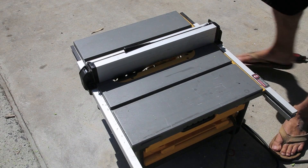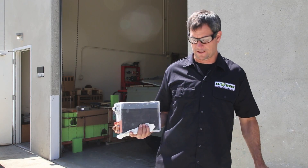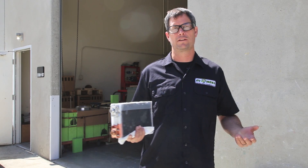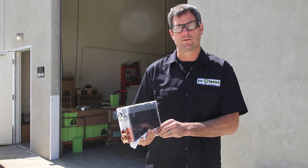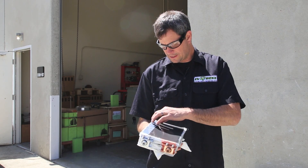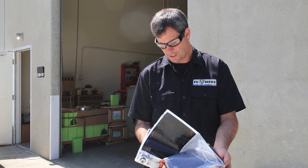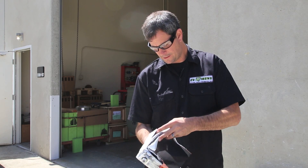Well, that was easy. We just basically cut the bottom off of the battery. Here's our case, and the anodes and cathodes just slid right out of it. There's just a little bit of electrolyte in here — not much fluid. It's not like your typical flooded lead acid battery that's going to have tons of electrolyte. It's just a couple drips and a little bit of dampness. Inside we get into the anodes and the cathodes. They're basically just a little carbonized copper sheet, and then underneath that is an aluminum foil sheet. It just kind of repeats all the way through — and that's essentially your battery.